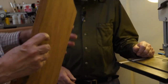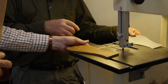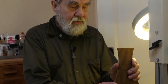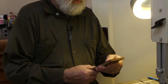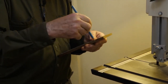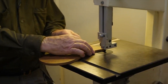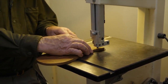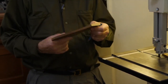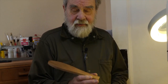Okay. So we'll come on to the next step. This was the piece of wood that we cut outside, and we had a little bit extra left over. So show us what happens next. That's just a template exactly the size of the one I'm making. Make sure it's square on there. Draw a line across. So this is now to get the actual final shaping of the bellows cheek. And then just cut it off. If necessary, I could give it a quick spin on the belt sander, but usually they're pretty straight. That's all there is to it, really.